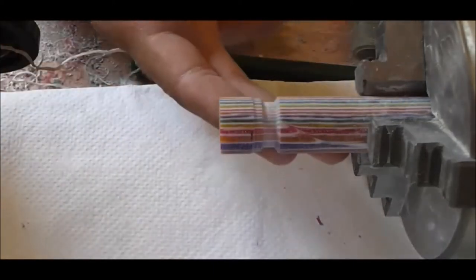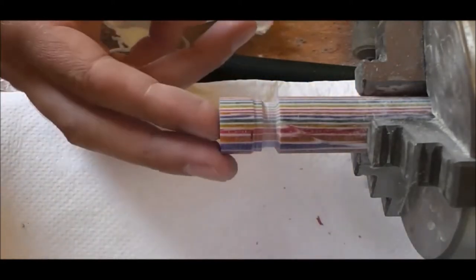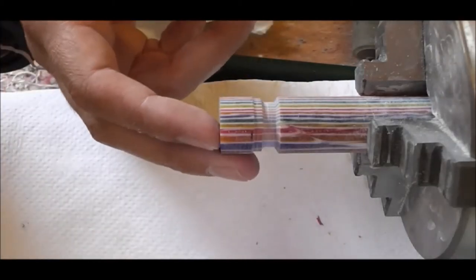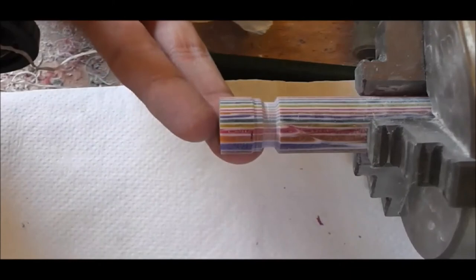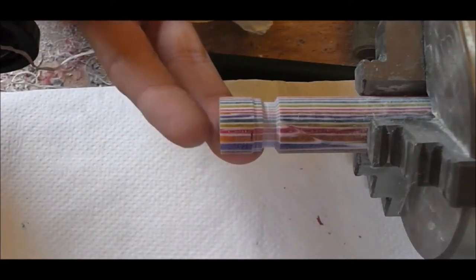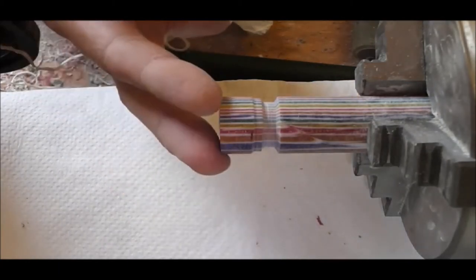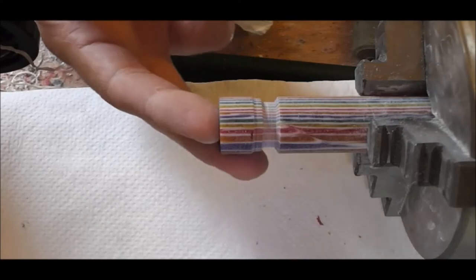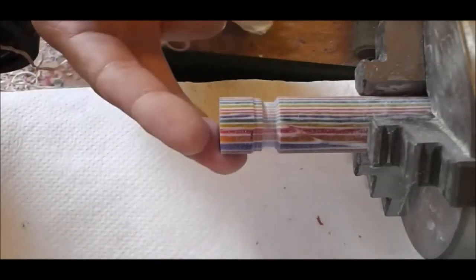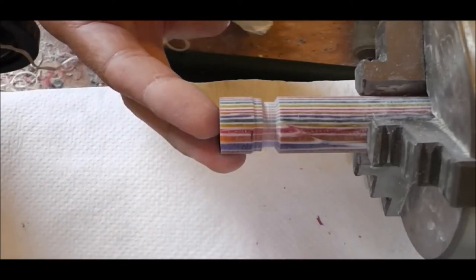Very simple, very quick, and I think a nice way of personalising a mod, to be honest with you. Pop away, do the polish. It's going to be all the usual process, right the way through the grits, starting with a 1500 of the micro mesh, then an 1800, then a 3600, then a 4000, and a 6000, then a 12000. Easy for me to say. I'm going to pop away, get the polish done. We'll pop back when we've got this cut off and down on the bench.